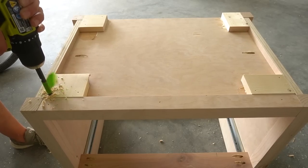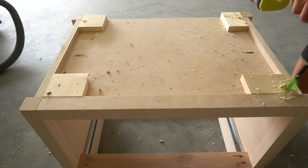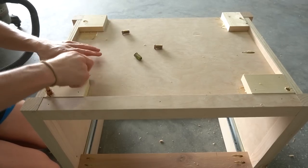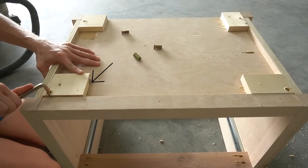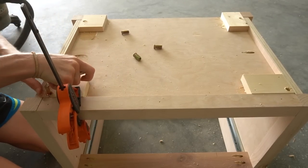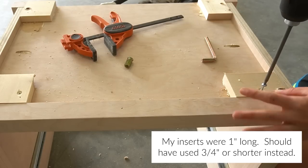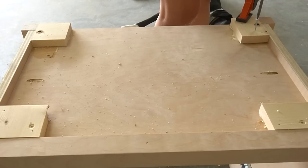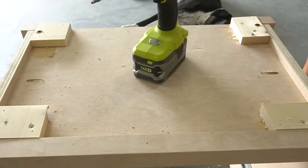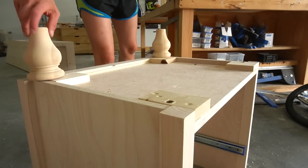You'll notice I didn't wait for the glue to dry, but I definitely recommend doing that. I marked two inches in from each edge at each corner and drilled a hole larger than the shank of the insert but smaller than the threads, just like pre-drilling for a screw. My scrap blocks started rising up because my inserts were a little too long — once they hit the plywood under the scrap block they started pushing it up. So I recommend getting shorter inserts. The ones I bought come in different lengths and I'll link the shorter ones in the description. Using solid wood, waiting for the glue to dry, and using shorter inserts should help you avoid these issues.